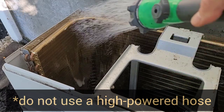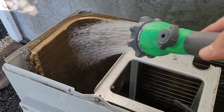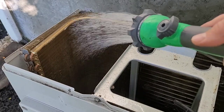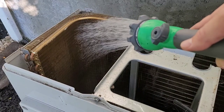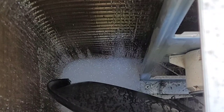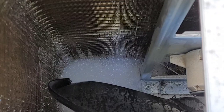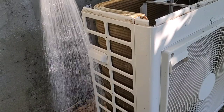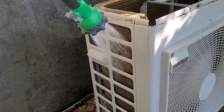Now I'm getting my hose out and starting to rinse. I'm mainly targeting the coils, so steer clear of the electrical components. I'm going to start on the inside and then move to the outside. I can see stuff coming down and it's looking clean. As I spray this down, I'm getting significant bubbles at the bottom, which means it's cleaning as it drains. Now that I've thoroughly rinsed the inside, I want to gently do the same thing on the outside, starting from the top and going down.